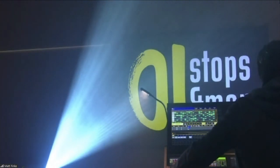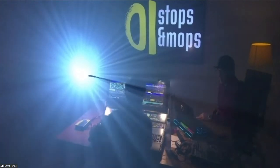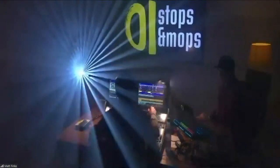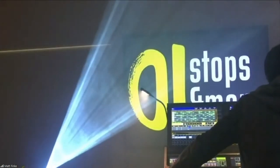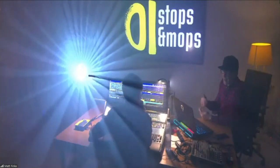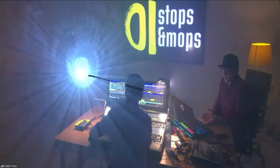So now she put the 27 prism in, so it's quite a lot of them already. Let's make the gobo smaller so we can see that they are separated. Maybe we can change the gobo into lines? Yeah, change the gobo into one line rather than so many at the same time. So we can see a little clearer. So now we have a single line gobo, 27 times, orientated in a rounded prism while the prism is spinning and the gobo is spinning too. Of course, it keeps all those values. It's acting like a standard lighting fixture.